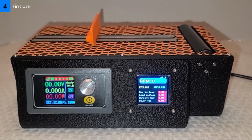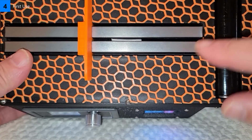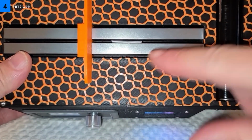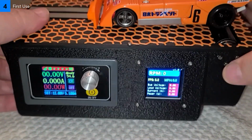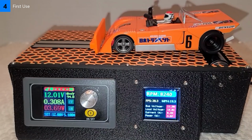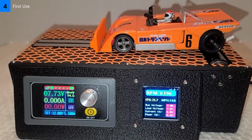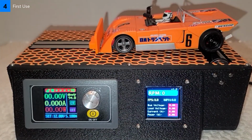When using the tech bench to break cars in, or if using the controller version of the tech bench, it is recommended that you place a small piece of tape or paper around your guide flag to hold your car in place on the tech bench so it will not roll off the back when the break-in time period ends, or when you apply brakes from your controller.